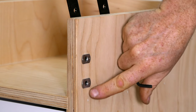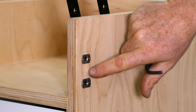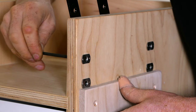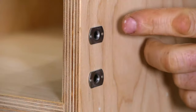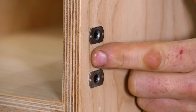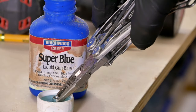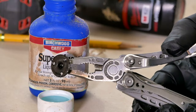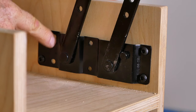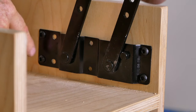Most t-nuts you'll find are round, and some have spikes that point inward. I actually like the ones that don't have spikes — these ones are kind of unique because they have flat spots on either side, so I can use a scrap piece of wood to keep them lined up to each other while I tighten them down, which just makes it look a little neater. These particular t-nuts are a nice metallic gray which looks good with this cabinet, but oftentimes t-nuts are a bright silver zinc — you can dip them in some gun bluing acid and it'll turn them nice and dark, which makes them match the furniture a little better. Also worth mentioning — I kind of messed up here: I meant to drill these two holes and instead did these two. It's not a huge difference, but the closer you are to the hinge point the better it stabilizes the bracket.